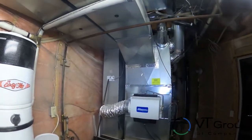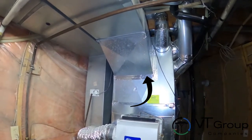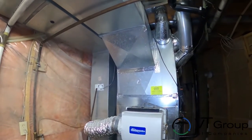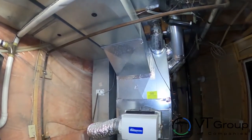You can see most of the joints on the ductwork have been sealed with foil tape, not duct tape. Duct tape will dry out and come loose. We want to get the heat to where we want it. But what we really want to talk about today is how do we control that ventilation and the fresh air coming in.